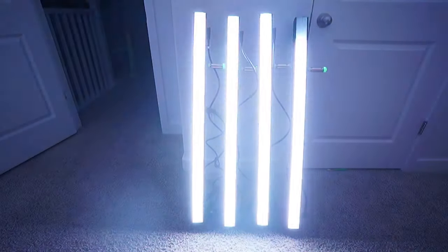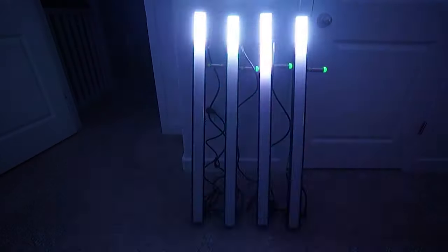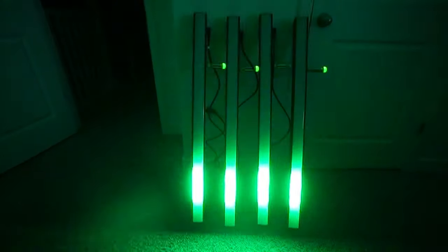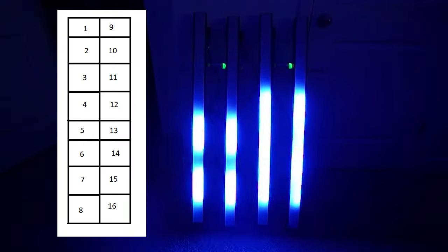I'm showing you a few of the built-in presets and patterns. You can access these through sound active mode or auto mode for a plug-and-play experience, and you can also select a preset and control the speed with DMX, which is what I'm doing here. All fixtures are using the same address. I have a simple Sound Switch show with 32 auto loops for these lights that I'll put on my website for purchase. I'm using the 53-channel mode because I can select presets as well as do custom programming in each of the 16 mappable zones. It's worth noting that it has two stacks of eight rather than 16 consecutive zones.